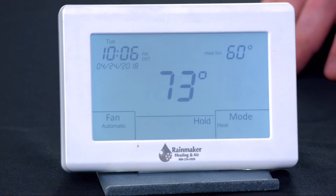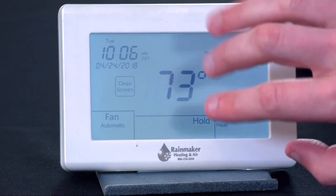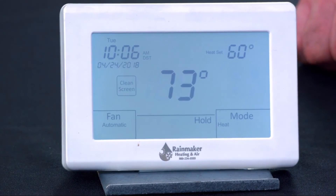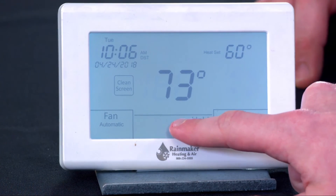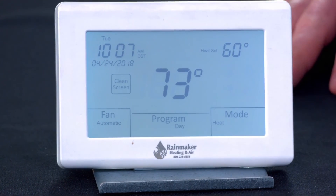There we go — it's not that complicated. The main difference is getting into the installer menus by holding those two buttons together, versus the programming by just holding the program button, then just follow the prompts. Let me show you one more thing. Once you're back on the main screen, if you ever make a manual change, you're probably going to see 'hold' at the bottom. If you see 'hold' at the bottom, all that programming you just did isn't going to do anything. Press that, and it's going to say either 'program' or 'hold' — you want it to say 'program.' As long as it says program, it's going to execute the schedules you just put in.